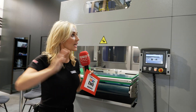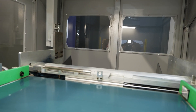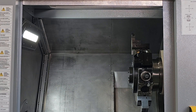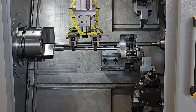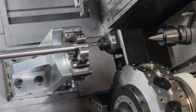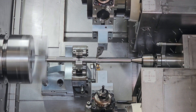This is about mass production of components — high productivity, high efficiency, and reducing cycle times. The journey of the part starts from the feeder: operators feed the parts in, then the robot takes the raw materials inside the machine, puts the raw parts in and takes the finished parts out. Then the robot comes back one more time for turning the parts after completing the first side operation, for the second side operation.